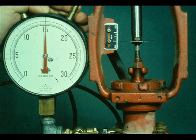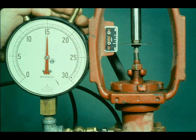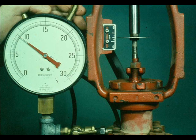Slowly apply air pressure to the valve and observe the valve stem travel. Note the input pressure needed to seat the valve, and make adjustments if necessary. You should make the valve barely seat at 15 psi. Then lower the pressure and screw the plug stem out two revolutions. Then lock the lock nuts. Check the valve for hysteresis, then commission it.